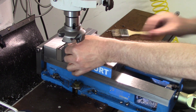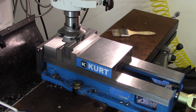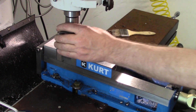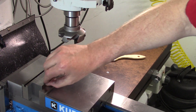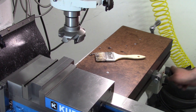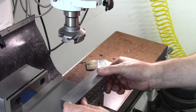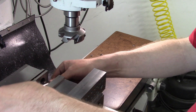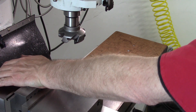We feel good. Everything's dead flush. I love the pins in there - it keeps it straight. We're still in back gear, so let's take it out of gear. And we better slow it down one notch too. We may not actually have enough metal sticking out of there to clean it up down to the dimension we want - 735. So that's not going to work. We've got to stick a parallel in there - we need a little clearance. We'll just take the parallel and put it on its side. It feels good.